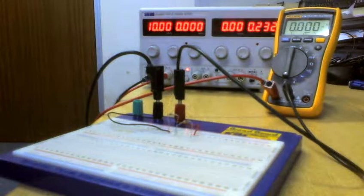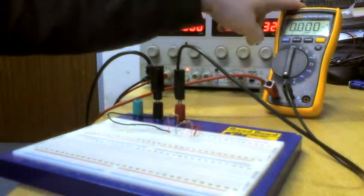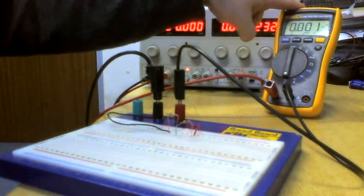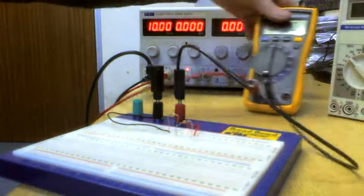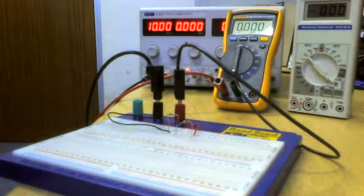The Fluke is a bad choice for measuring this particular current. New meters don't necessarily mean better meters — sometimes the older ones do the job a little better. That really highlights the fact of what I said earlier about having two multimeters, even two different models, because you may want that extra range. No one multimeter can do everything: some are good at measuring high values, some at low values, some at intermediate values but not particularly good at the high and the low.